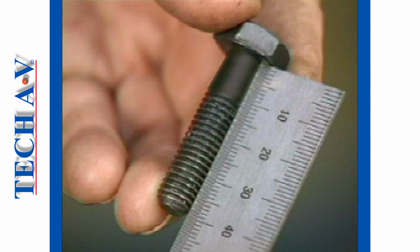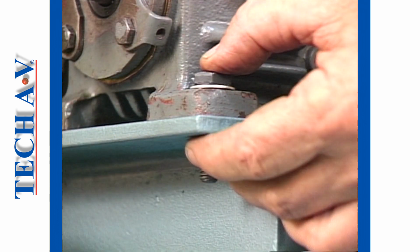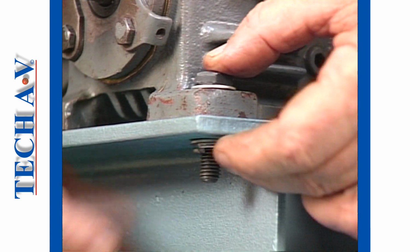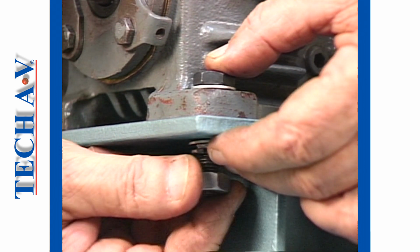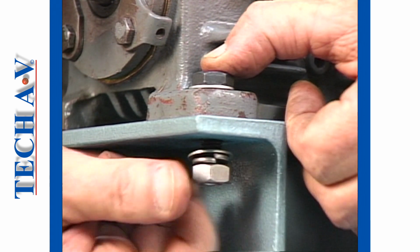In practice, we would be able to purchase 40 millimeter bolts, which, for our purposes, will be satisfactory. The grade of bolt for our application must be superior to commercial grade, so we'll select the 8.8 fastener. The correctly described and ordered fasteners can now be fitted to secure our gear unit. After the break, we'll look at other replacement criteria.